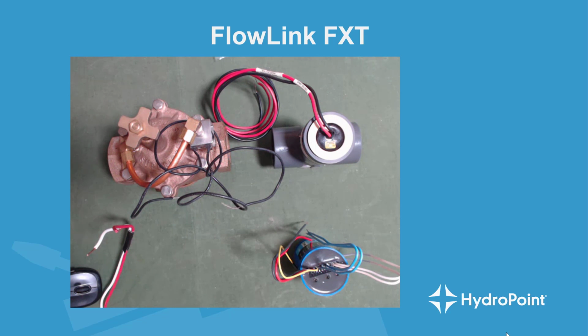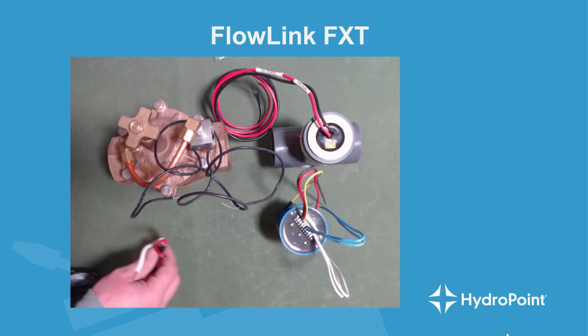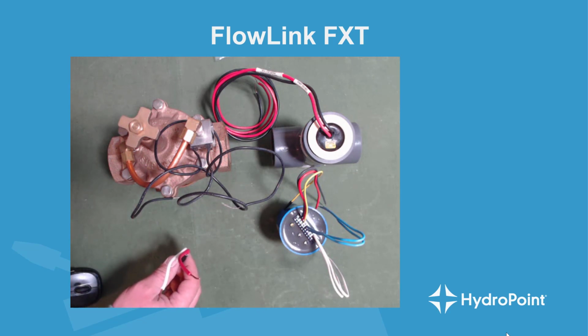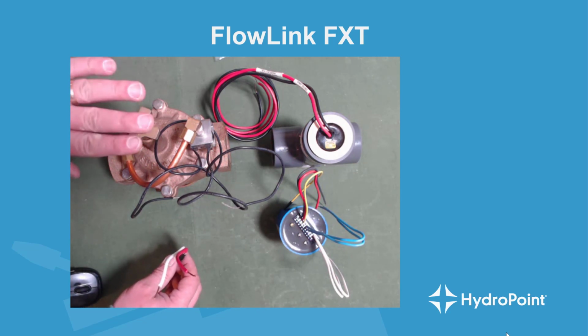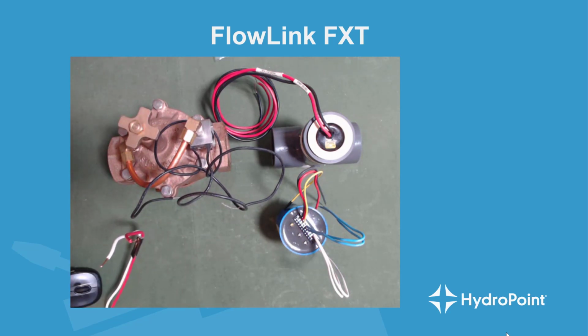And inside the valve box, you'll have your master valve, your flow sensor, your FXT, and the two control wires. These two wires might be the hot and the common wire that you just disconnected from your master valve, or they could be the two wires that you're running across from your EXT, which we'll talk about in the upcoming segment. If the installation of your master valve and flow sensor require that the two devices are in separate valve boxes, you can easily extend the wires on the FXT by just adding a wire nut and enough irrigation wire to reach the other component. Either way, when all of these components are correctly installed, we're ready to wire them up.